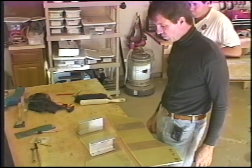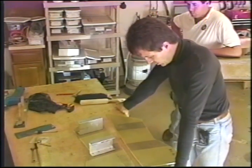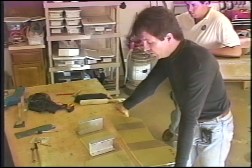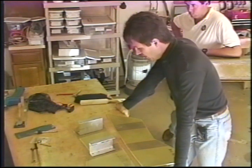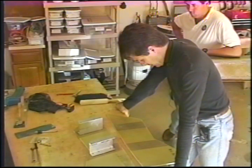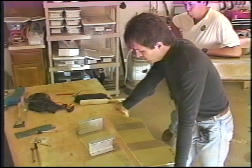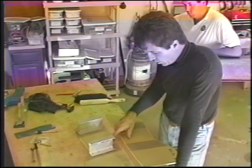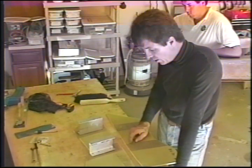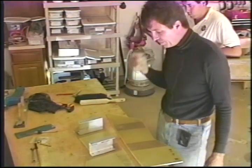Okay, we've trimmed his MG30s. Now, you might notice a ragged edge here in the bottom. Wayne here has an unusual machine in that his fuselage core is half-inch thick, and yours is 3/8. All of yours are 3/8, all of you but Mackie Chapman, and let's see, a gentleman in Malta. If you have quarter-inch fuselages, you want to leave an 1/8 inch more material on. If you have a half-inch fuselage, you want to take an 1/8 of an inch more off. But 99.9% of all production airplanes out there are 3/8 and don't change anything. Go cut right to the line.